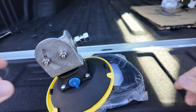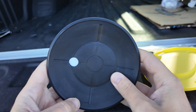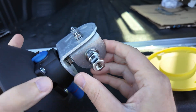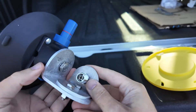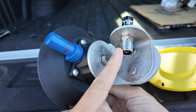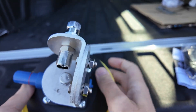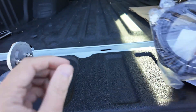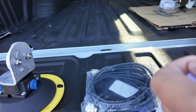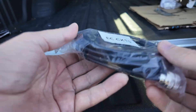It comes with coax too. So this is a suction mount — look at that thing — that you can stick onto something, and then it has this pump to get all the air out. It's adjustable; you can adjust the tilt on the antenna mount. It's a 3/8-24 thread and an SO-239 on the bottom. It's got a little cover to keep the dust off. And it includes a 15-foot section of RG-58U coax — that's what the EC-CX15 stands for. This will work perfectly for the 857 because both the mount and the radio have matching SO-239 connectors.